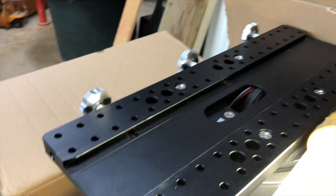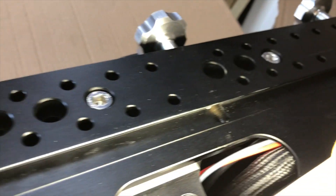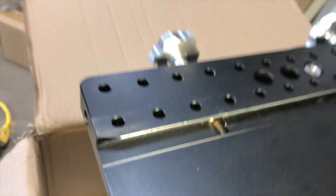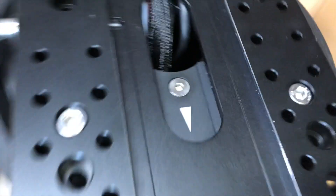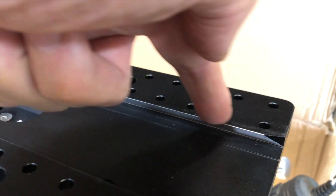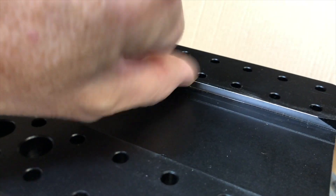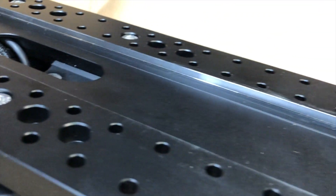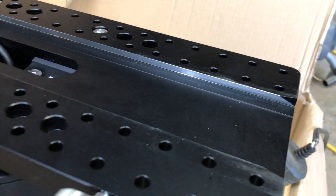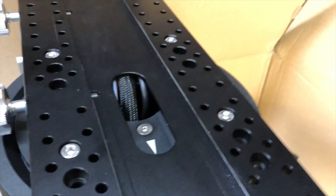First of all, just to show you, the pins are completely pulled back so there's no binding on the thumb screws. Also, I just wanted to show you that on this side, it appears that there has been some additional machining to make it a little wider. You can see it's shiny in there — the anodizing is no longer there, it's been machined off. So I'm guessing that means this one has been attempted to be machined a little larger to work better. However, it's still not doing the job.